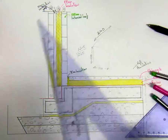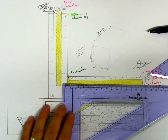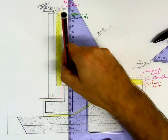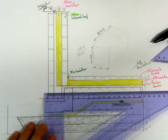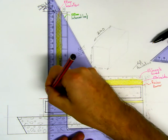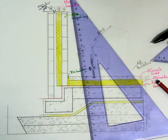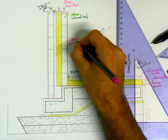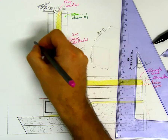We're missing a few parts still, so we need to put on our internal plaster and our external plaster. Our internal plaster is 12 mil — so it's 1.2 mil at scale 1 to 10, so 1 mil or 1.5 mil will do just to represent it. Then our external render is 18 mil — so at scale 1 to 10 that's 1.8 mil.